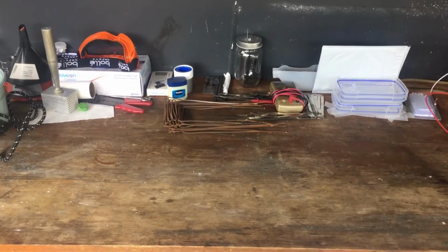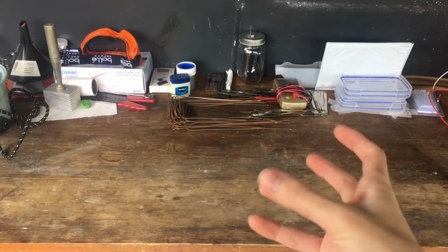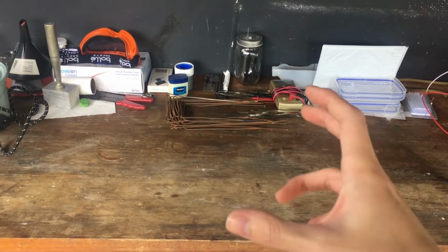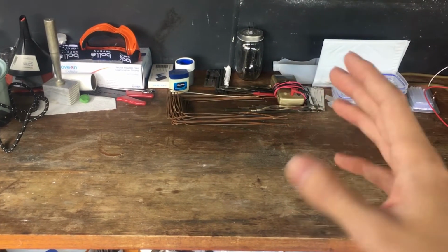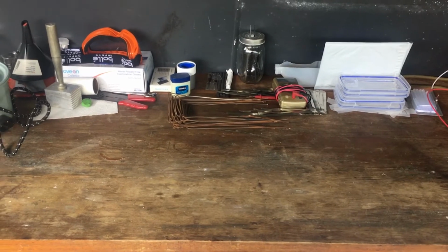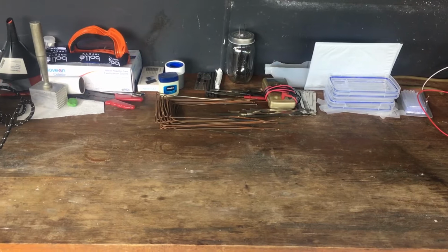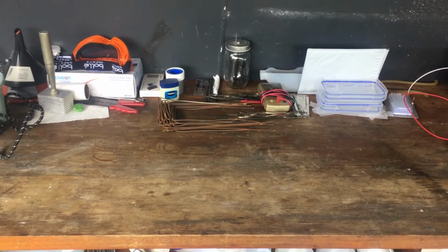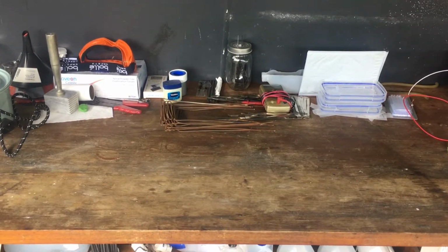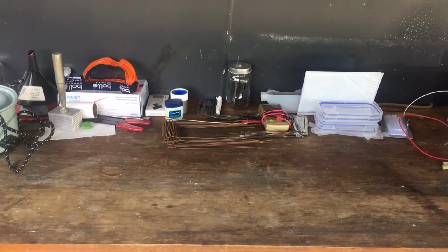The microwave oven transformer that we're going to be working with in this video outputs around about 2000 volts and has no kind of current limitations, so it will happily just shove a whole amp of current through your body, killing you without even tripping any kind of breaker. So definitely something to be fearful of and treat with a lot of respect when we actually set up to do our Lichtenberg figures. So please, it is very important that you don't actually try any of this at home.